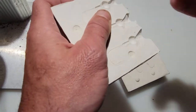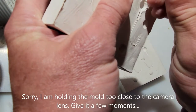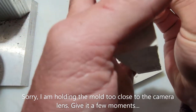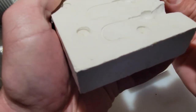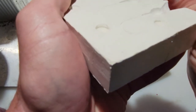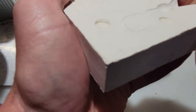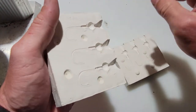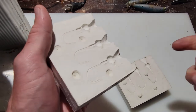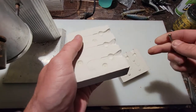And it's really easy. It's not a hard process at all. You just got to make sure you do it. Otherwise, the lead with it being hot, and once it does that drastic cool down, it will stick or grip to these ledges and everywhere that it's basically gripping to, all these places where there's shadows, it's just gonna break the mold. So again, we'll get rid of all these, make these smooth and flush, and that'll make for a much better mold. Sorry, I was out of screen for a while. Let me zoom out a little bit. There we go. All right.